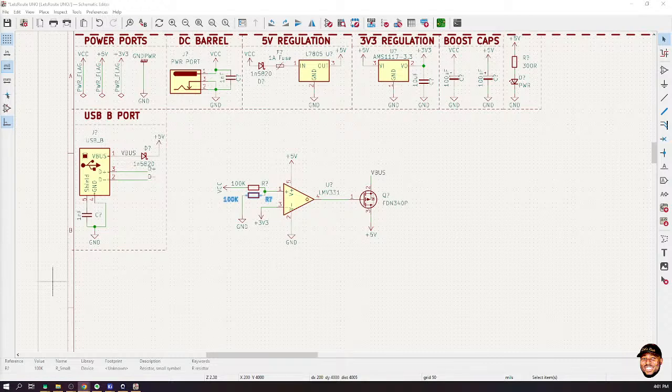Okay, so you see, a surge protector usually is supposed to flatten out spikes. When we say surges, take surges as temporary or transient voltage spikes in circuits. For instance, if you have lightning outside, it could lead to surges. If you have noise around your circuit and you are dealing with sensitive signals, it can cause some spikes. These spikes are usually in the form of voltage rise. So a surge protector is supposed to flatten out these spikes. It doesn't necessarily shut down the system, right? But a fuse works differently.